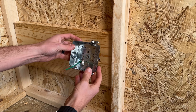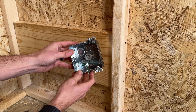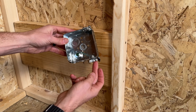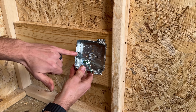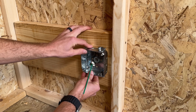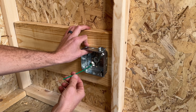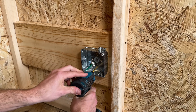Back on the inside, I'm going to place a 4x4 junction box. I'll be passing an extension cord through that is actually my power going to the line side of the GFCI — that's my power coming into the shed. In my case I'm powering from a portable power station in here, so I'll pass the cord through here to plug into the power station and wire that back out to our junction box. Then I'll be passing out to some outlets and up to some lights, bringing everything together into this junction box. I prefer metal boxes — they hold up better, allow me to clamp my Romex down securely, and you need to be grounding all your different boxes.